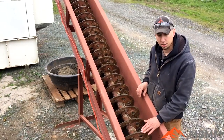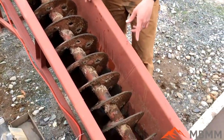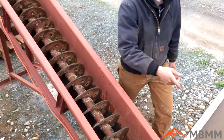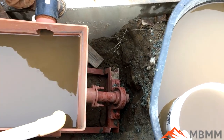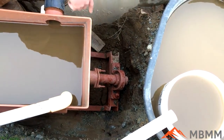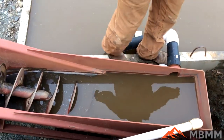A lot of people ask how long the flights will last. We've had this in our system for a couple months now, run several tons of material through it, and you can see the paint isn't even worn off the flights yet. The wear on the machine is very, very little and these flights will last a long time. If you come down to the end here, you can see that we keep the bearing outside of the slurry — completely separate from the water. The shaft penetrates the basin, so you don't have any grease in the water, and you don't have slurry and grit getting into the bearing and wearing it out. The bearing is completely removed from the high-wear area.